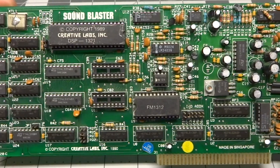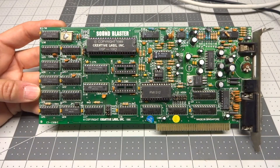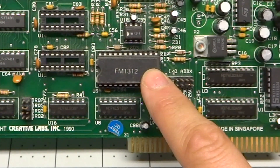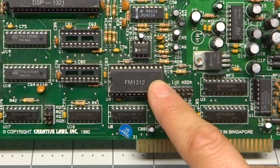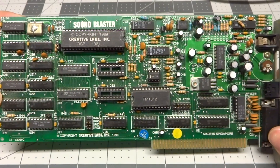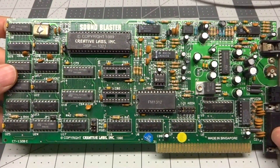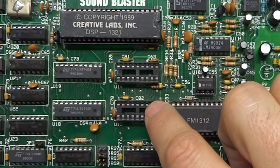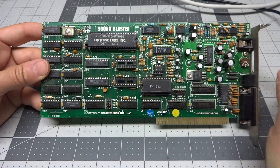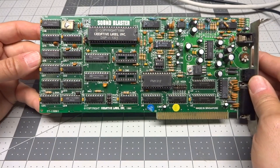This brings me to the next card — the one you probably know really well: the Creative Labs Sound Blaster. Originally released in 1989, the original version included AdLib compatibility by using the same Yamaha synthesizer chip, which is under this sticker here, bringing OPL2 and AdLib compatibility. But it also added actual digital audio. These original cards supported 8-bit audio playback at 23 kHz in mono, and could also record 8-bit audio at 12 kHz in mono. The earliest 1.0 cards carried on with Creative Music System support — these two sockets were populated on the very early cards and included those Philips ICs to produce square waves. The later card like this, which is considered Sound Blaster 1.5, omits these chips but is otherwise exactly the same as the original card.